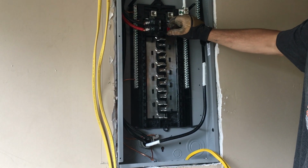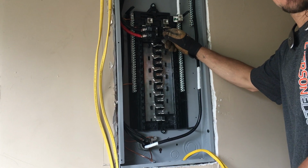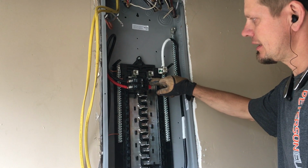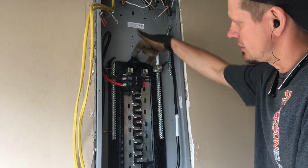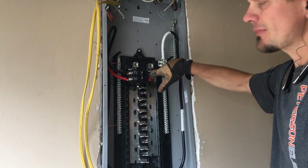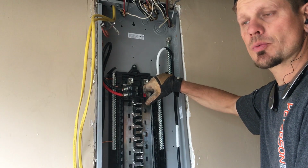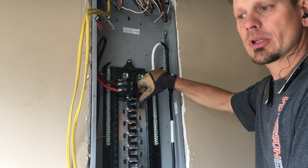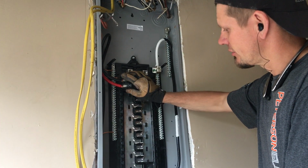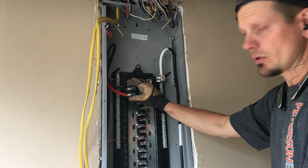Right here's a retainer clip. If any of you guys watch my video, if you don't mind sending me that code, I've had a hard time finding that. I know that that has to be there to retain it because we don't have it as a main breaker here, but we have it on the bus bar. I think that might be in 404 under switches or 230 for services. But anyways, so that's our main disconnect, 125 amps. That's the max that they would allow us to have.